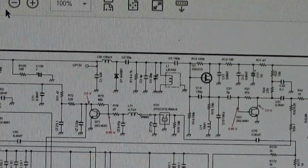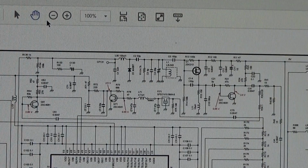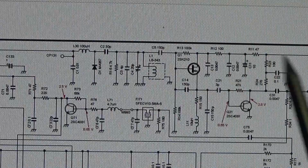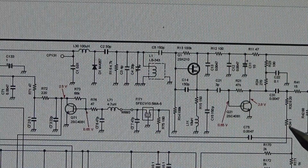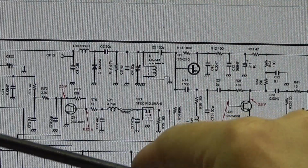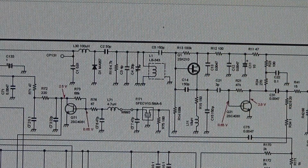And up here, all around our Q1 is our ref loop VCO. And we should find here an output frequency around 10 point something megahertz, okay? And this frequency will be fed back. Let me see that I find the right way to this little amplifier. And this amplifier will then give this feedback frequency to the input of our ref loop PLL.